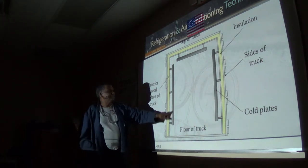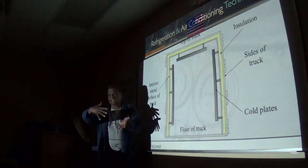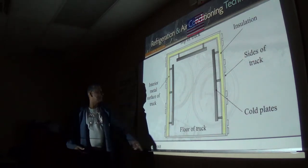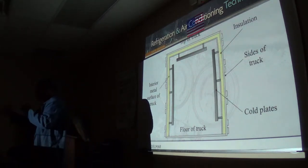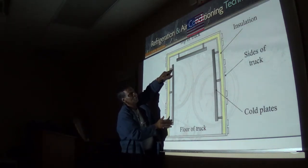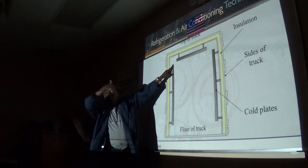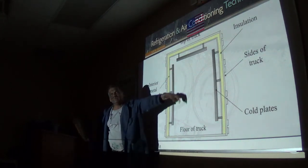And these are the cold plates of this truck here, okay? So, normally, what I do when this truck is in the loading dock, by the way, this contains a liquid in there that as the temperature gets low, it tends to form crystals. So when you're at a dock, you have the plant there, you're hooking up two lines. Of course, these are interconnected. And you're pumping in cold solution into here, and you're pumping out the warm solution back into the system